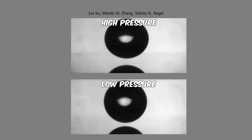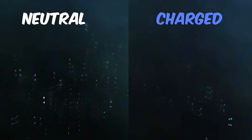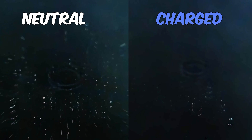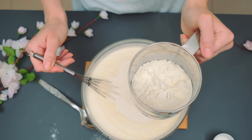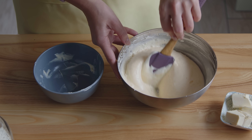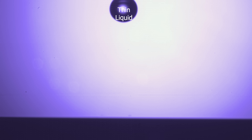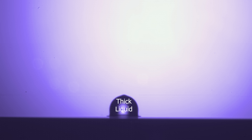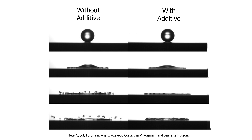If I lower the pressure, there isn't enough pressure to push the lamella up and out. If I put a charge on it, it induces an opposite charge on the plate that sucks the lamella down onto the plate. But there's one more thing we can change, and that's viscosity. For example, you can add corn starch or flour to make something thicker, but the problem is the whole liquid becomes permanently thicker and hard to work with. What we really need is a way to make any liquid stay perfectly normal most of the time, but suddenly resist flow under the extreme shear rates of a splash. Researchers recently discovered that with the right kind of additive, that's exactly what happens.